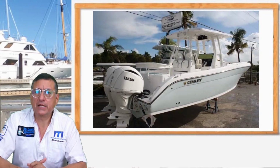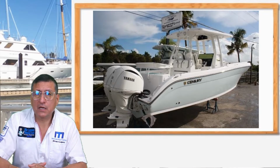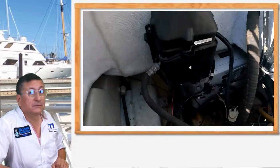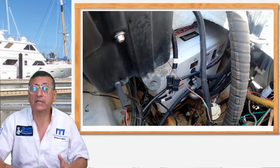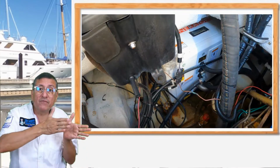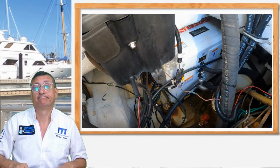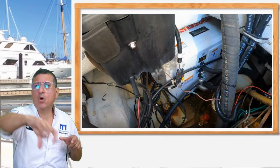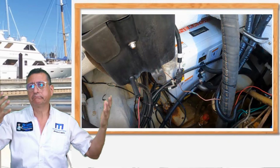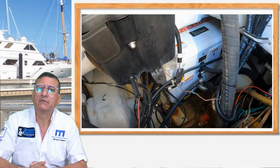Okay, what happened with the generator? Let me show you where the generator was originally located. You see, in that corner, the generator was located originally, coming from the factory, Century. The generator is in the transom of the boat, in the center of the bilge, at the bottom. When the boat accelerates, normally you have water in the bilge, and all the water comes back and damages the generator. This is a worse design. For that reason,